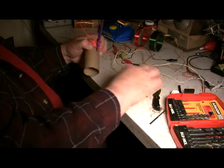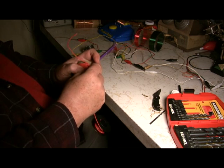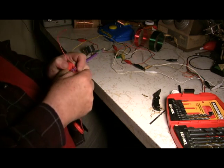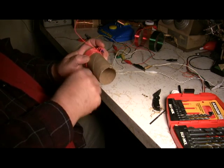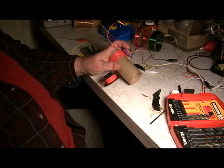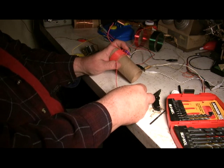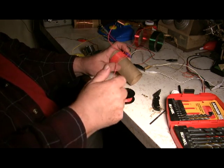Go around again — now we're coming up and we want to make another tap. Let's wrap it around and put our pencil through it. This wire is probably not the best to use with this technique; it works better with the light enamel wire. With the thicker stuff, you twist it and it pretty much stays there. I would put as many tapping loops as you can on there because that gives you different areas to work with. Later on, if you want to permanently mount this, you can run wires off each one of those taps to a switch and just switch them that way.